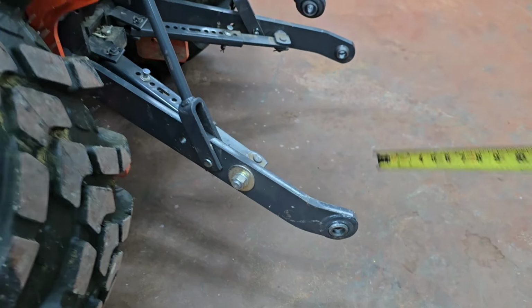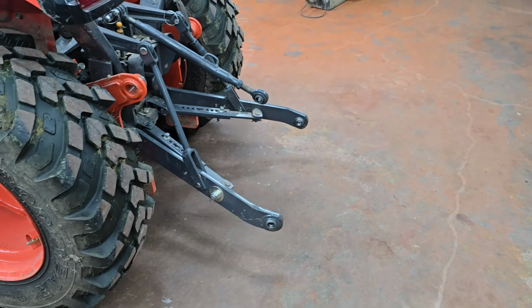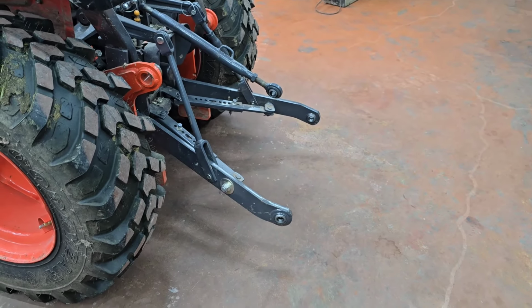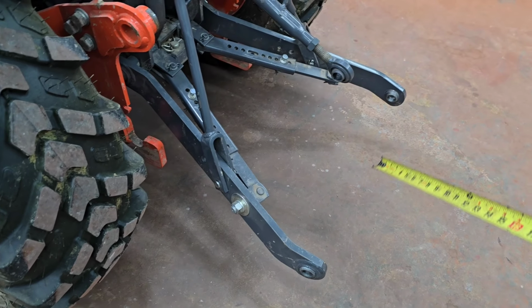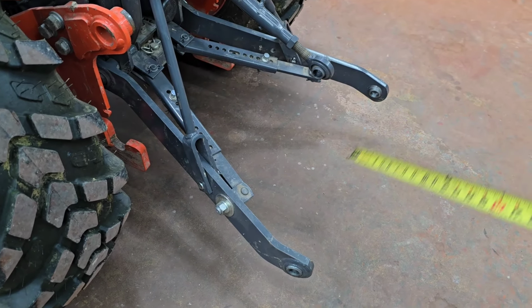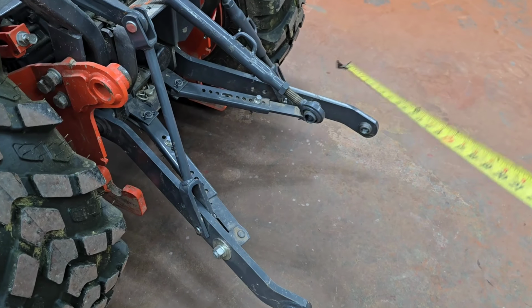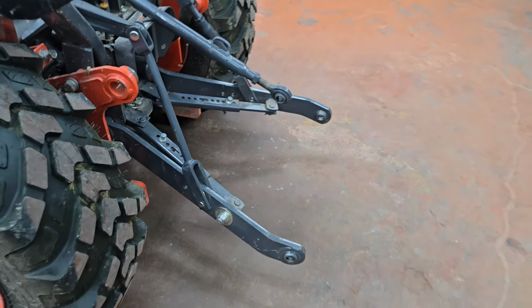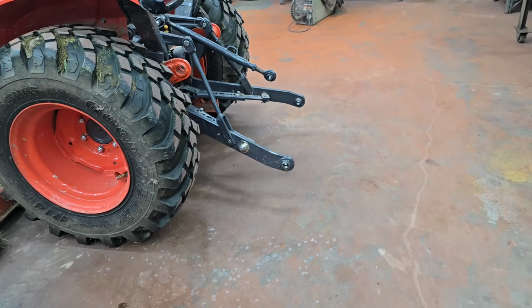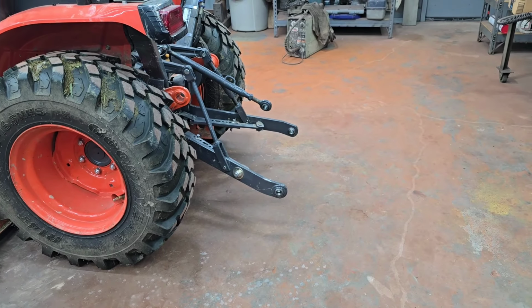And these arms, they're all the way down. So that part right there is as low as it'll go. Now, the next thing to consider would be the distance between the elevation of those holes. Obviously, the elevation of those two holes are going to be the same. But now we got to make a third hole for this arm. And what I'm using to decide that is the distance off of my tiller.